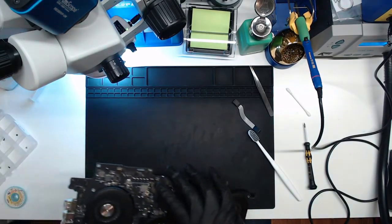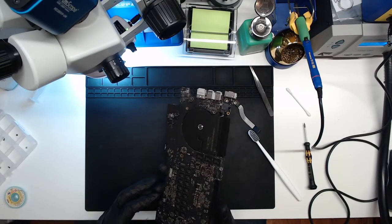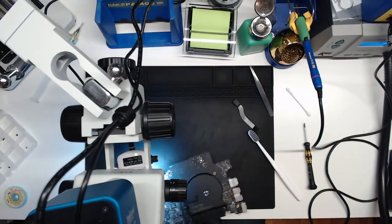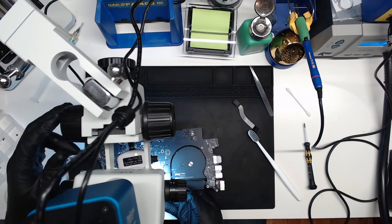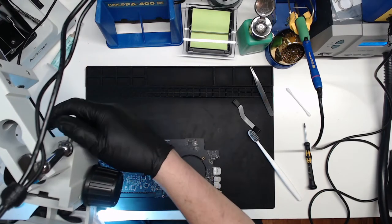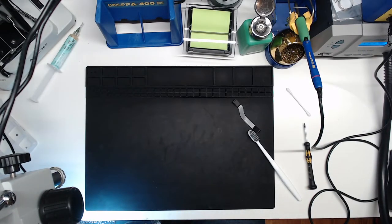And in turn, it breaks the solder joints on that IC and makes it to where you have no video. And what I'm told from other videos and stuff is Apple's solution, I've never seen it myself, is to put a piece of shoe rubber, or a piece of serrated rubber, on it to help the case smash down on the chip.